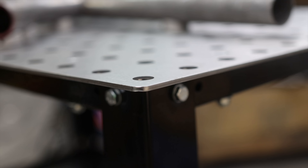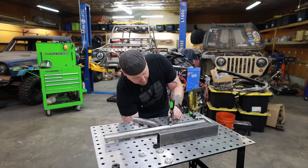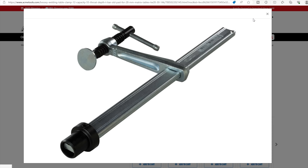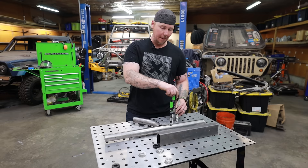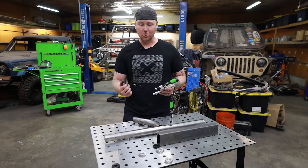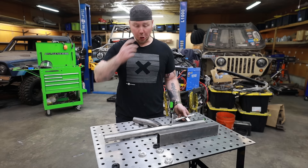This table is three sixteenths of an inch thick — it's not going to take very much to bend and distort the holes. A good example: the clamps that come with this table — four of them, which is pretty cool for the price — have a nut to back them, whereas higher end tables just use a five-eighths rod you drop in the hole. Once you start clamping it puts side load on the table and locks in place, but with something this thin I wouldn't want to do that because it'd be so easy to bend and distort those holes and get the table out of whack.